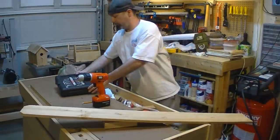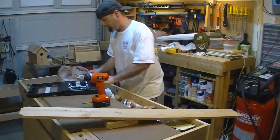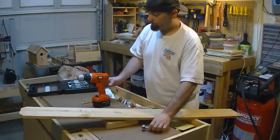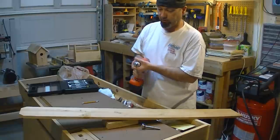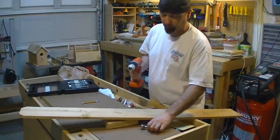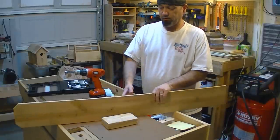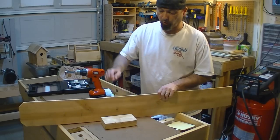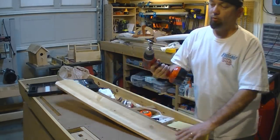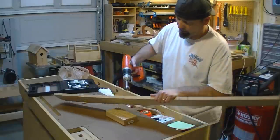I will now get a one and a quarter inch Forstner bit — this one right here. I'm doing this all with a 9.6 volt drill, so this isn't terribly thick material — if this can get through it, anything can. Now, this is the outside of the box and the mark is on the inside. So I want to go from the outside, and using this pilot hole, get the little pointy part of my Forstner bit into the center hole and drill about halfway through.